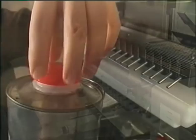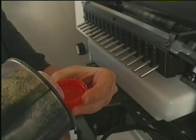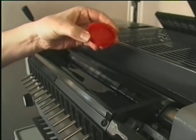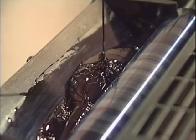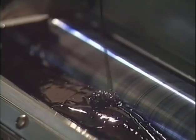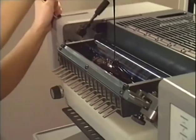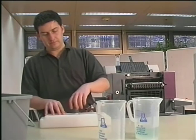This will reduce the possibility of ink migration to a minimum. The inks have to be exactly tuned into each other when printing via one common blanket. The ink in the first unit always has to have a higher tack. If that is not the case, it is always possible to add printing oil in printing unit 2 to reduce ink tack and viscosity to the required level. The added amount has to be measured very carefully — do not use too much printing oil. If one of the inking units is not needed for a job, you should apply resin-free oil on the inking rollers in order to protect their surface.